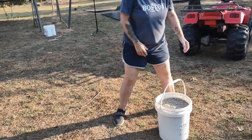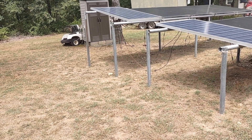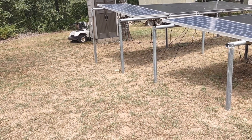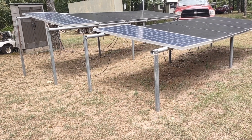What do you think that weighs? That's just one bag of cement — 80 pounds. This is going to be a two-day job. What we're going to have to do is dig the holes today, set the poles, level them all out, put the cement in, and wait for them to dry. Then tomorrow we're going to be back putting the rest of the racks up so we can add the other two panels.